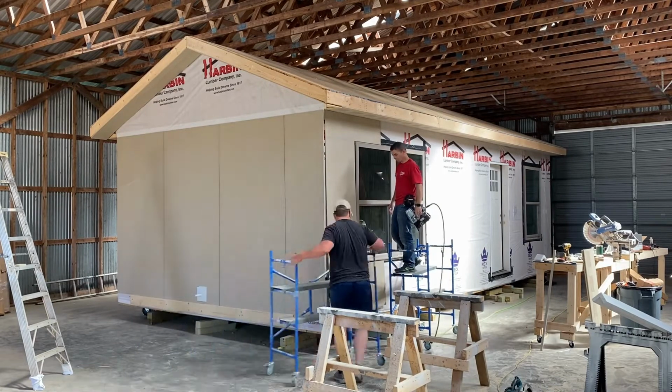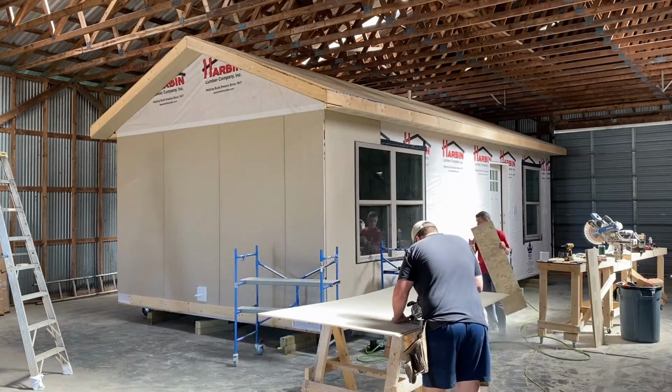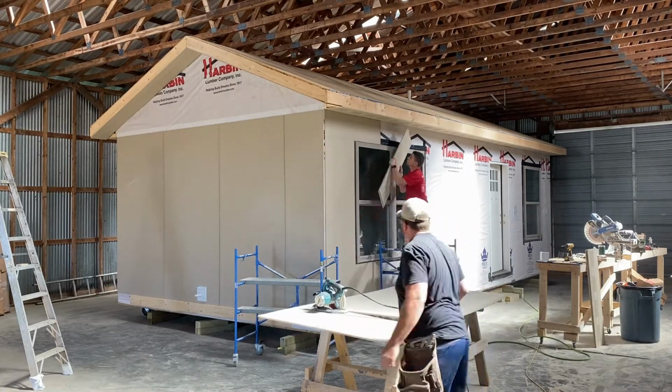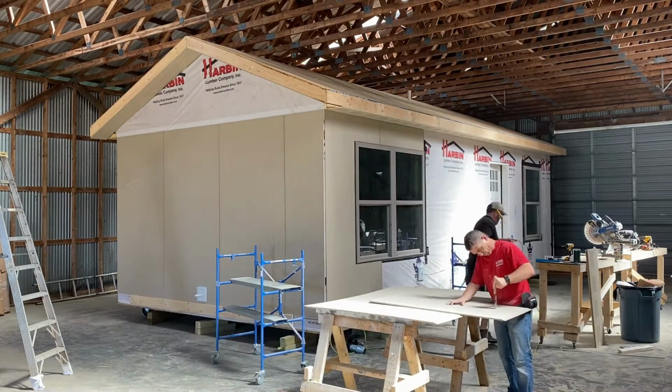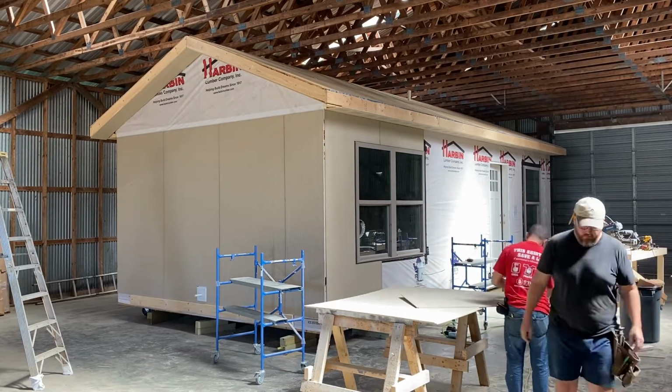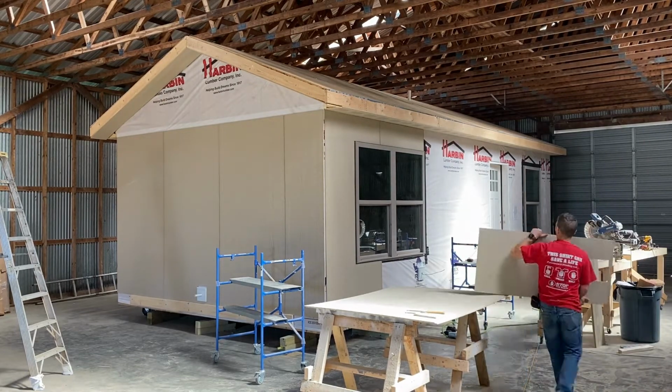So as always, things start to slow down when you go to cutting around windows and doors, but taking good measurements, making good notes, and allowing your cut man to basically just be able to hustle through this and not leave them much room for mistakes definitely makes this a lot less of a headache.